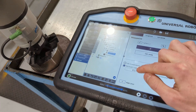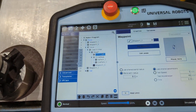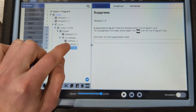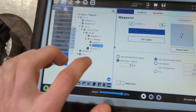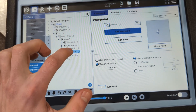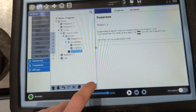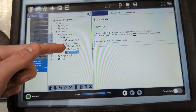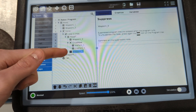The other weird thing I had to do: I have a waypoint 3 here. After waypoint 2 and the circle move, the end point kept resetting its blend radius to zero and it would stop right in the bottom corner. For some reason, putting a waypoint there allowed it to hold its 0.1 blend radius. I just blocked it out with this button — there's on and there's off. I don't know what's going on internally for that to happen, but putting this here and blocking it out, it works just fine.